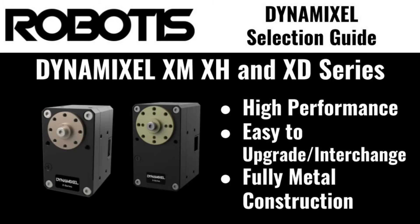Then comes the XM, XH, and XD series. These form the backbone of the Dynamixel product line, with the XM series providing the best all-around value, perfect for mid-size robotics and industrial automation. The XH series is an improved line based on the XM series, providing additional capabilities as well as high-voltage models designed for use alongside P-series actuators. The XD series is in turn based upon the XH series, with an emphasis on increased durability, resulting in over 200% increased expected lifetimes over the equivalent XH model.